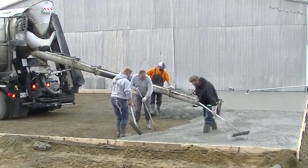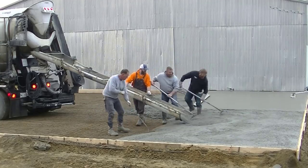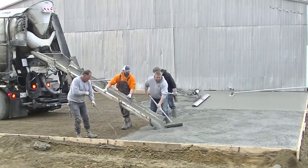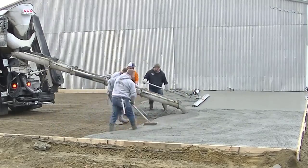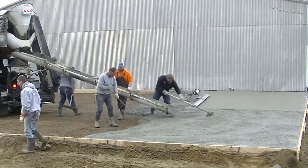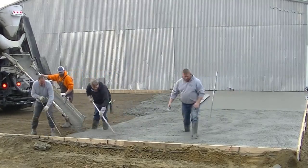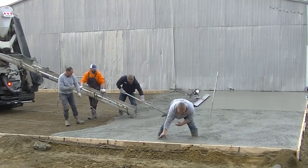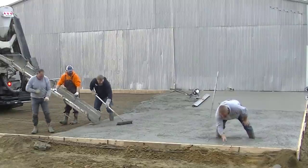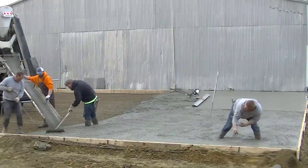This one's 2,400 square feet, but whether you're doing 5,000 or 10,000 square feet, you just pour it in sections about a truck at a time like this. You're trying to maintain a wet edge so you don't have what's called a cold joint. A cold joint is when one of the loads starts setting up and getting pretty firm while you're pouring the loose stuff next to it — you don't want that.